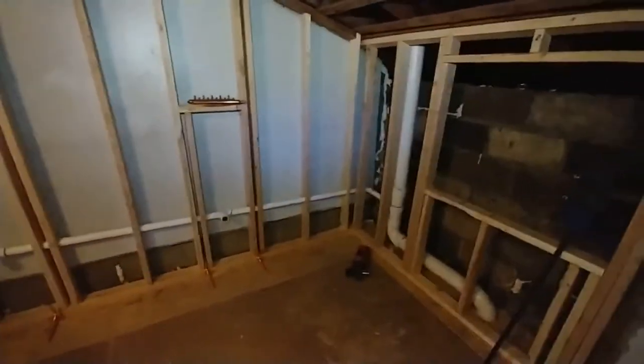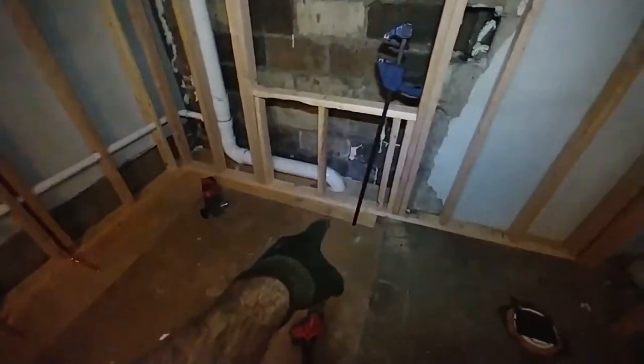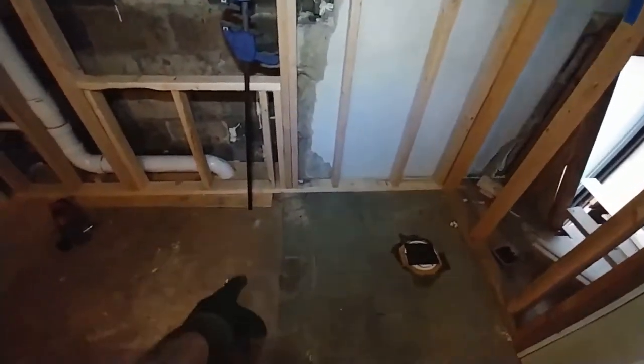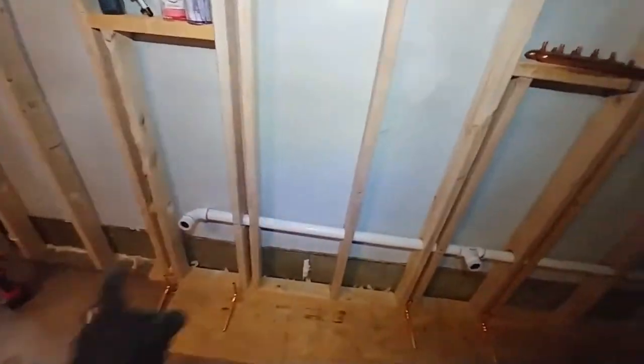Okay, plumbing drains are in, battery saver's on now apparently, but the stack has been connected, and after it goes through the floor here, it runs around and catches the toilet. And then continues down there, shower comes over and joins the toilet and goes down. And then we get the sinks here. Just a little bit of fall on the way down.